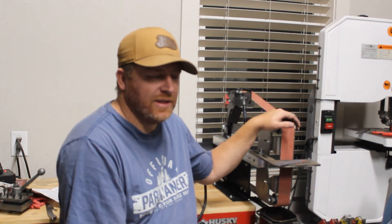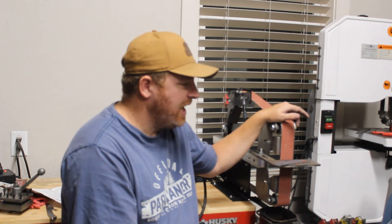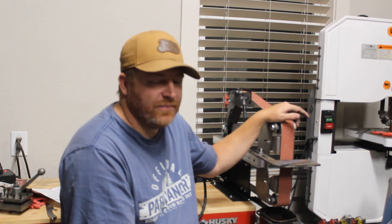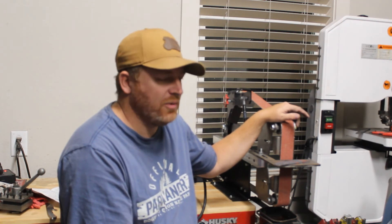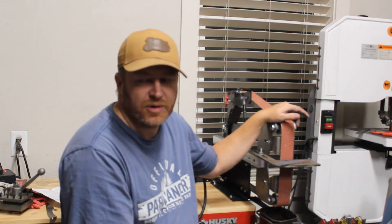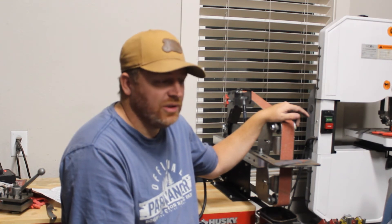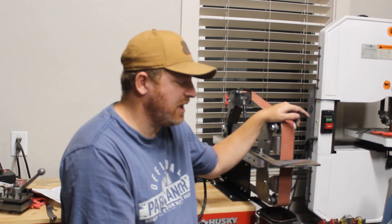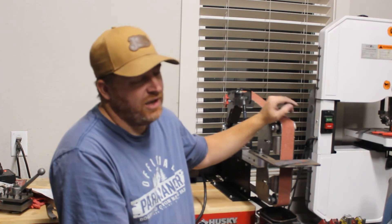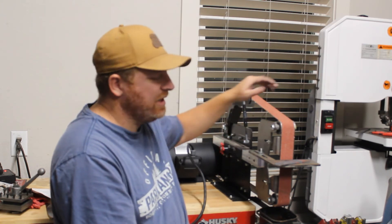The new motor is mounted. I still need to find some more screws, but at least I can access them. The reason I'm stopping — I've got a smaller drive wheel on now. I was running a seven-inch drive wheel, but the bore size: I thought this was the right bore size, I think it's a half-inch bore, but it looks like it might be three-quarter or an inch. Luckily I went through a lot of wheels in my time and I think this one is from my original DC treadmill motor, so luckily I had something that fit. I'm currently plugged into an extension cord that goes inside my house.